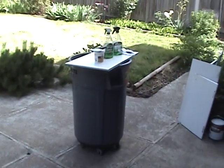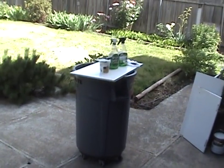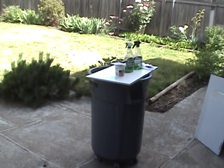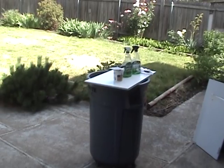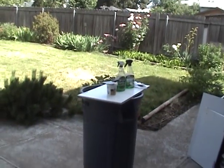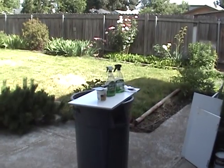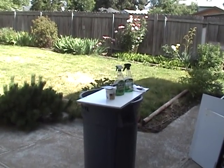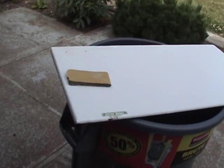Let's start — we're going to clean a couple of the cabinet doors, do a little sanding, and I'll show you how to use the wood filler, which is no great mystery. This is my approach to simply painting cabinets by brush. I've cleaned and scuffed this cabinet face and the other side with a sanding pad.